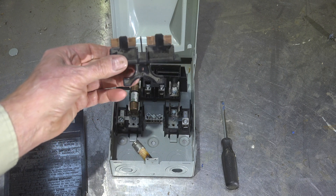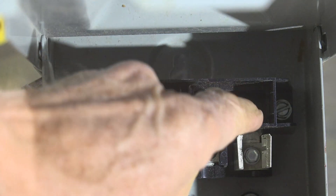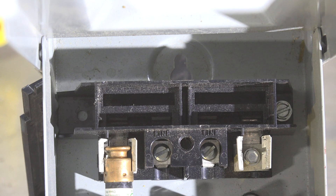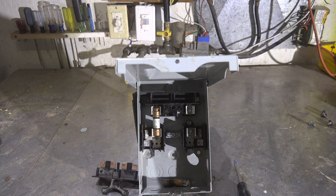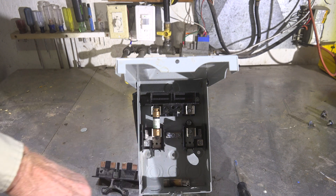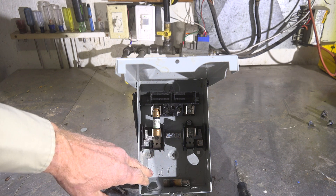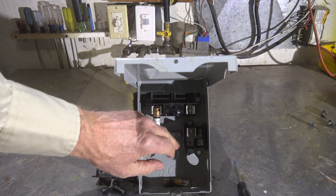I've never found this plug part at the parts house - if this part overheated, it's also overheated the internal parts, and the disconnect is toast. When you come on to something like this with a fuse that looks like that, replace the disconnect - there's no other fix. If you try to squish it down and put a new fuse in, all it will do is blow the fuse again. The plastic inside or up top could be melted - all those things can happen, usually due to wires not being tightened or just not making good contact.